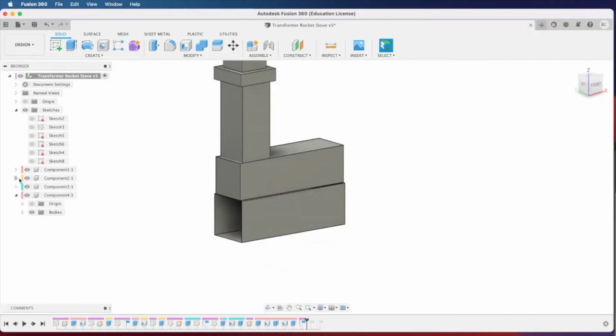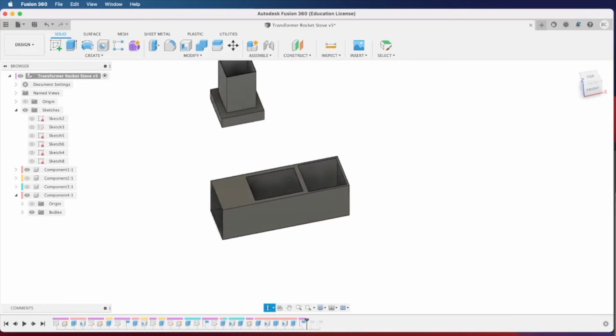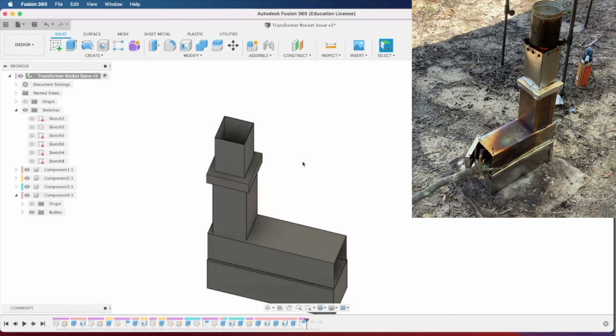To allow heat from the combustion chamber at the top to transfer down to the oven, there are 2 big holes you can see now open up so the heat can transfer more directly. And this hole is also important to make up the rocket stove. We'll show you later. The third pipe, the vertical one, allows the heat to be transferred to the top, where you can put in an additional section, the chimney, to enhance the chimney effect.